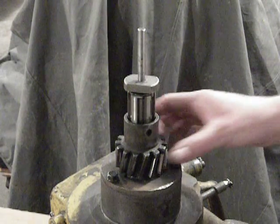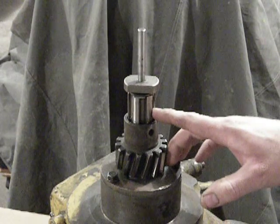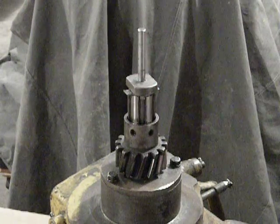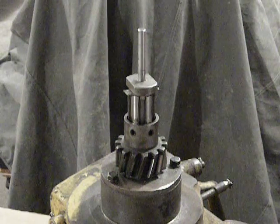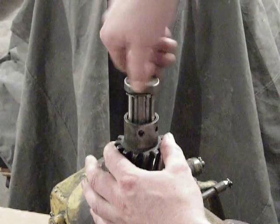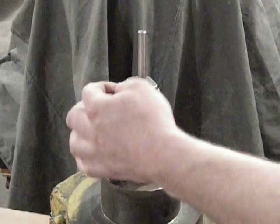In this case, I already have the pinion gear on the shaft. The kick-out springs are already inside the shaft, I have the kick-out plunger rod positioned under the nut, and I have the fold-over lock in place under the nut as well. Proper alignment of all these pieces is absolutely critical to the correct operation of the system. What we'll do is just run the latch nut down until it tightens in against the lock.